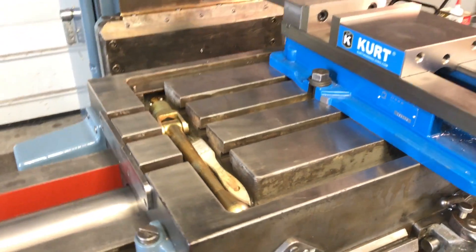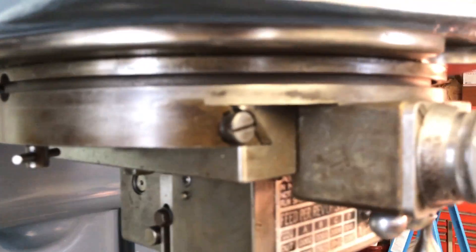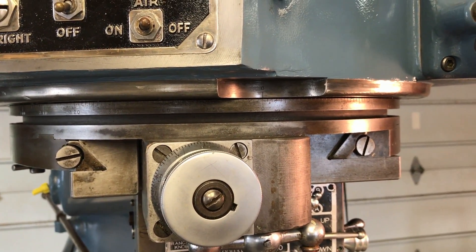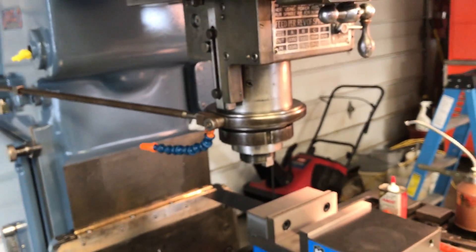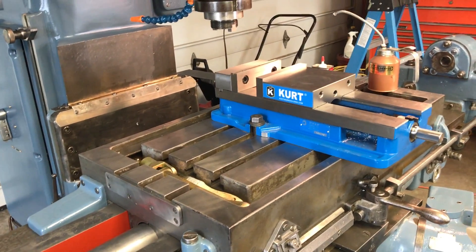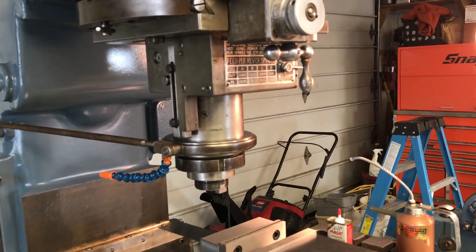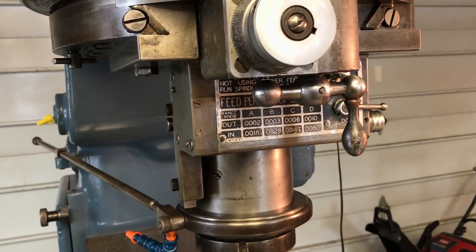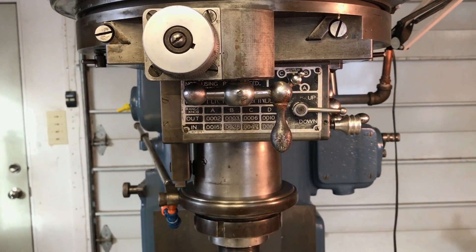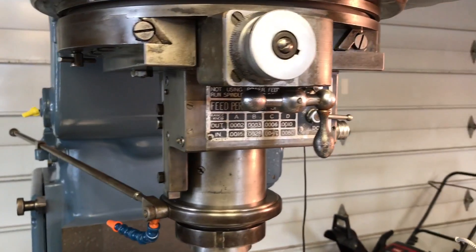This table had the machine just about a hundred percent apart. The only things I haven't taken out are the rotary head bearing and the rotary head carrier with the degree scale on it. Everything below that has been off — the table, the knee, the doors, electrical, the spindle — all been out, repaired where it needed to be, replaced where it needed to be. Most of the bearings in the power feed have all been replaced. I did not replace the spindle bearings — they were in really great shape and they're a little more expensive bearing.